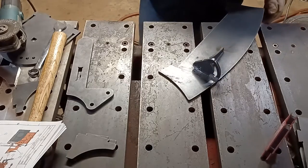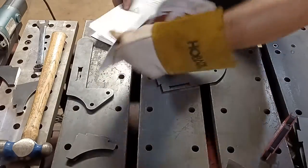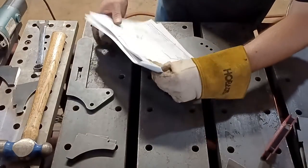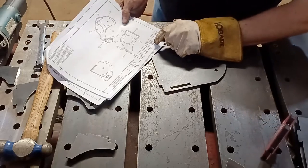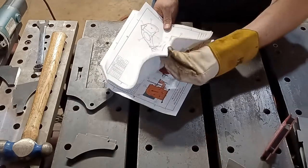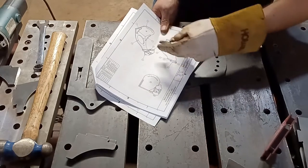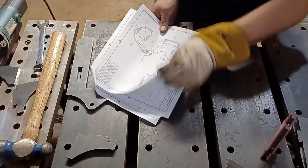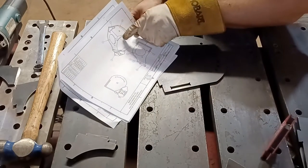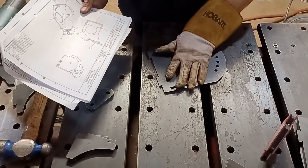The next weldment we're going to do is the tilt assembly. Up here is a list of all the parts we'll need — you can flip through the plans to find the actual parts, or look at the pictures and match them up. The build plan pages give you dimensions to make sure you have the right parts. It looks like these gussets are both the same, which is great — that's why I'm starting with this one, because the other assembly has two gussets that are not the same, making it harder to mess up.